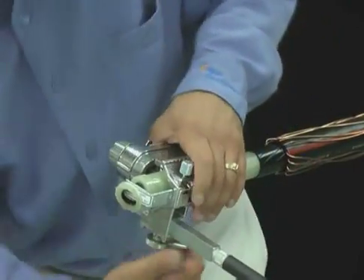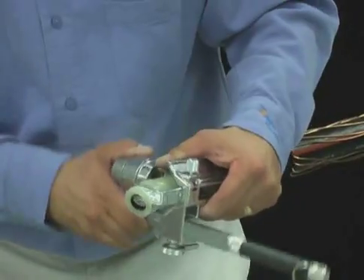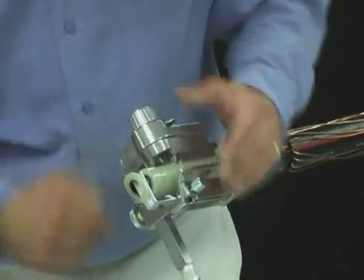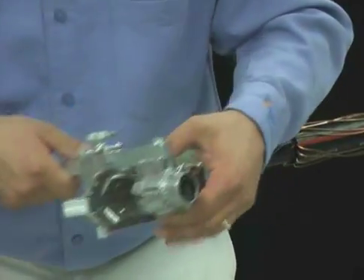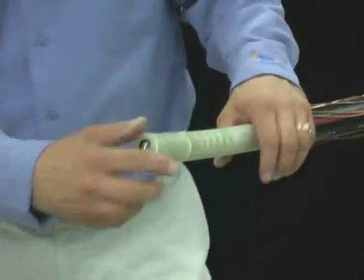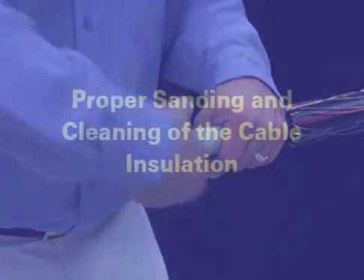You can also click over to square cut if you do not have the ruler attachment. Loosen the tool and remove from the cable. Spiral the insulation off and confirm the dimension.